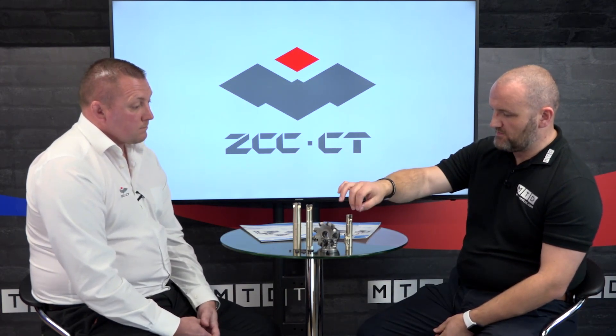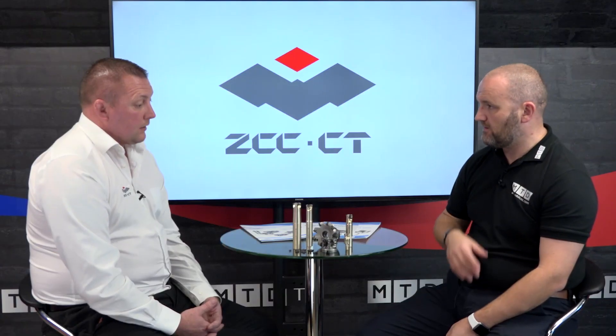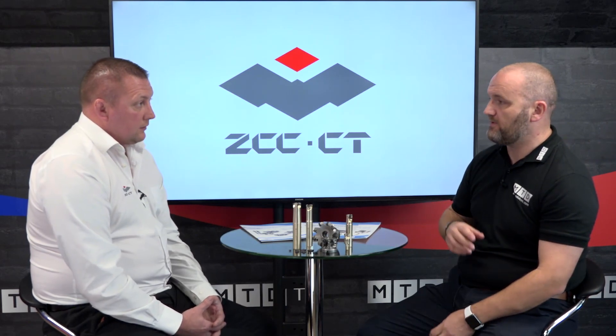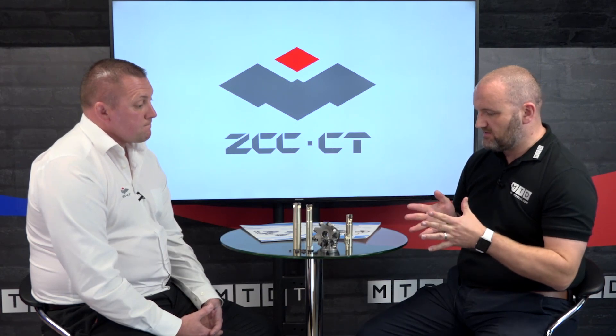I can see some of these go down to quite small diameters. What is the range from the smallest to the biggest? With the complete system, including the APKTs, we start off at 12mm up to 160mm. And grades — you see a lot in mould and die, but how about duplex and super alloys? Yeah, we cover all materials: carbon steels, stainless steels, super alloys, and titanium as well.